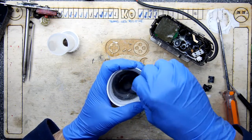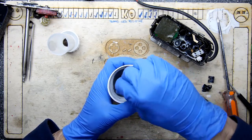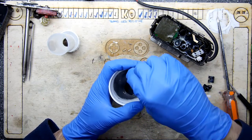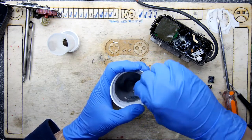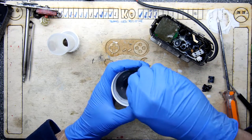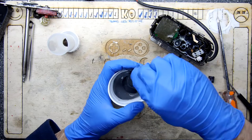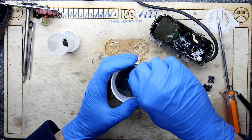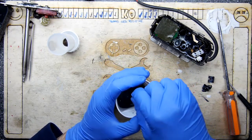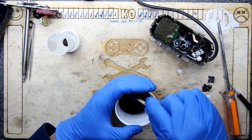Condensation cure silicone is pretty safe stuff. If you're going to do it, you want to err on the side of too much rather than too little, because if it doesn't cure, whatever object you've got in there might not appreciate being inside for 24 hours before you've figured it out. It takes a day to cure at normal room temperature and humidity, so if you've got a sensitive item in there, by the time you get to the next day it could have started to swell or warp or change some physical parameter.